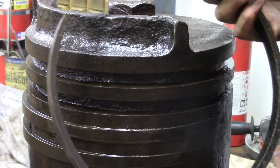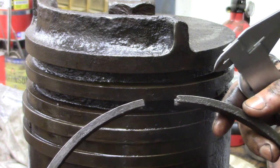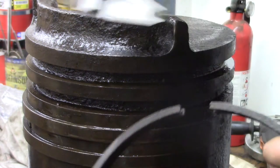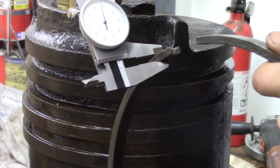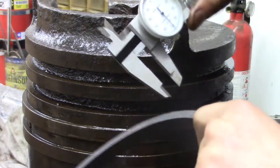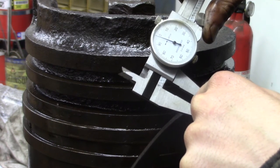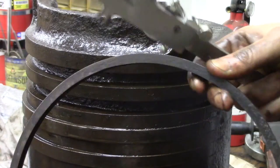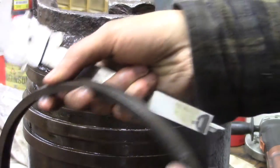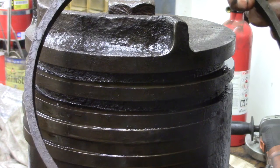That's not too difficult. Now that I have one of these rings off, I can see it's actually not in terrible shape — I'm sure they would have been just fine. But up here it's a lot thinner than down here. On this end we've got 202 and 226 thousandths, and on the other end we've got 297 thousandths — almost 300. So it's definitely worn, quite a bit worn off. I'm sure they would have worked fine if it wasn't for this ugly rusted spot, but what can you do.